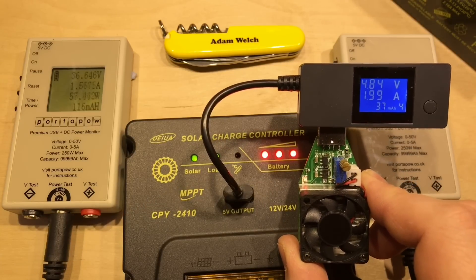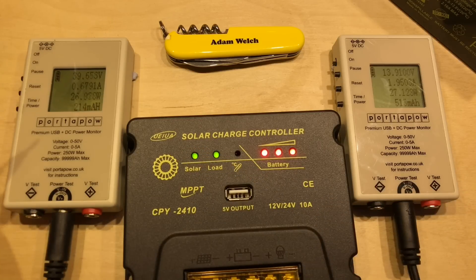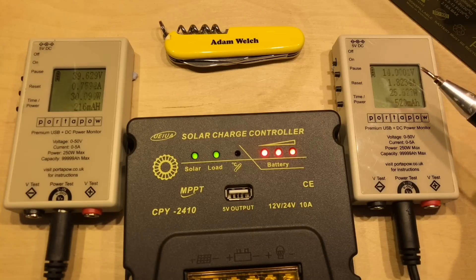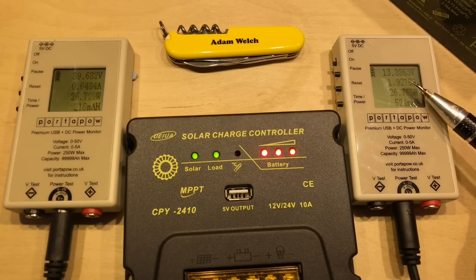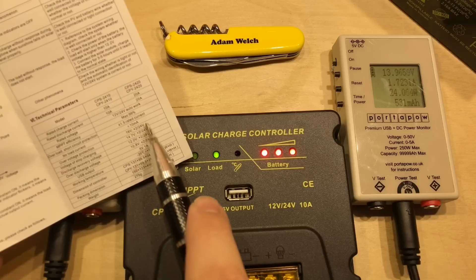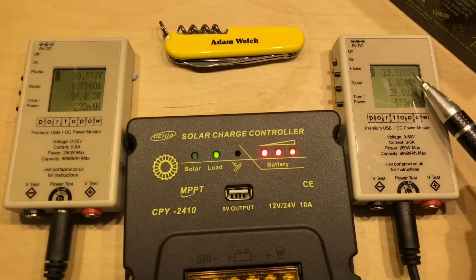You'll notice the solar LED has slowed its blinking - the panels are closer to their open-circuit voltage and we're bringing in less current. It seems to be regulating the panels down because we appear to have hit a float stage at 13.9 volts on the battery, with current reducing slowly. The manual doesn't mention a float voltage or equalization - just a stop-charging voltage of 14.7 volts. So it looks like it's regulating at about 13.9 volts, which is possibly a little high for this AGM battery.